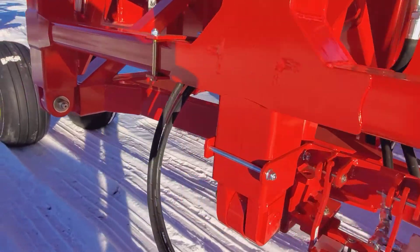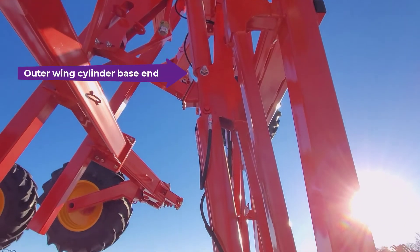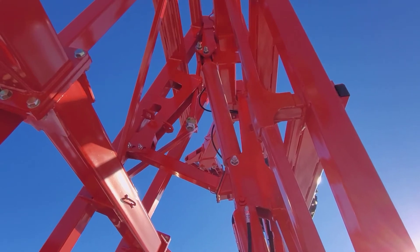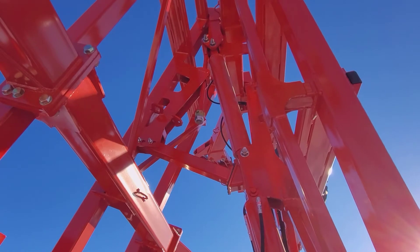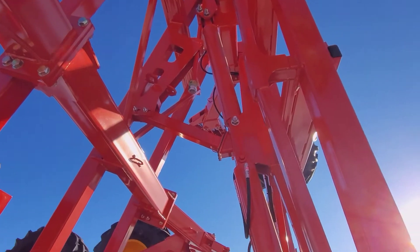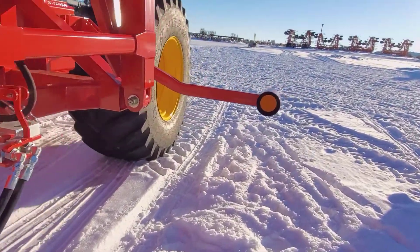The mainframe is very heavy and we're going to damage the cylinders if excessive pressure is applied. The outer wing cylinder has a fixed pin on the base end, very close to where the inner wing cylinder is fixed. On the rod end, as we can see in the top of our picture, it goes to what's called the coffin back. This assembly is allowed to swivel and the rod is allowed to free float in this arm, meaning the outer wing cylinder simply extends fully and sits with some pressure on it all day. It keeps those openers in the ground with a weighted rear arm, which adds weight to that small wing section to keep it in the ground and ensure adequate trip and packing force. The inner wing is a very large section of the frame.